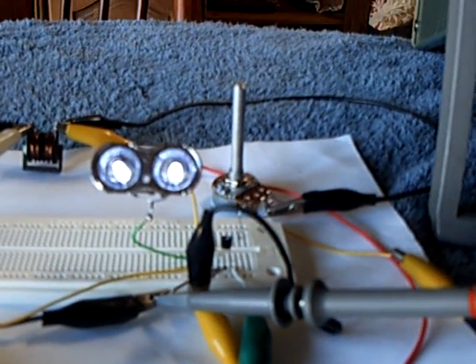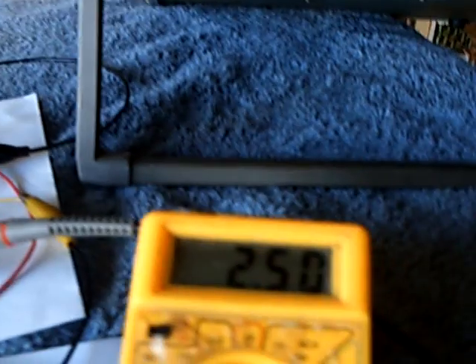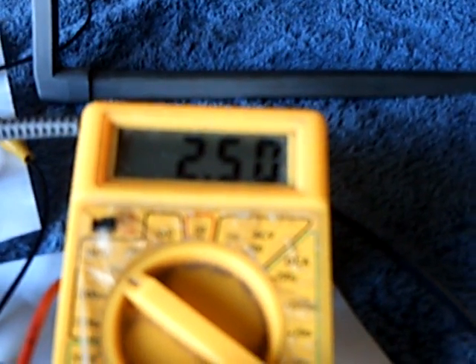The voltage on the capacitor and the drive battery is right there, and I can take the battery off or I can take the capacitor off, and it runs on either one. The energy stored in the capacitor drains down much faster than the energy in the battery. There are more joules in the battery than there are joules stored up in that capacitor.